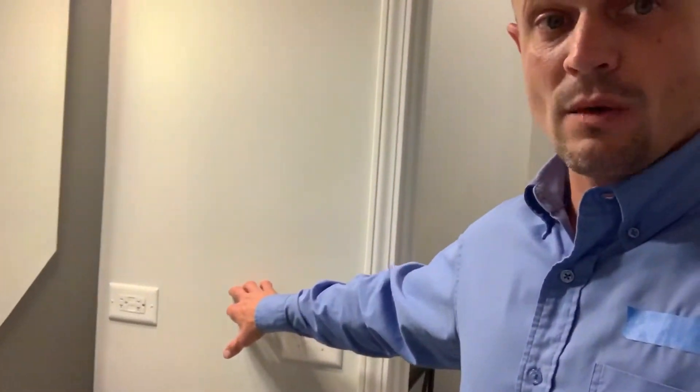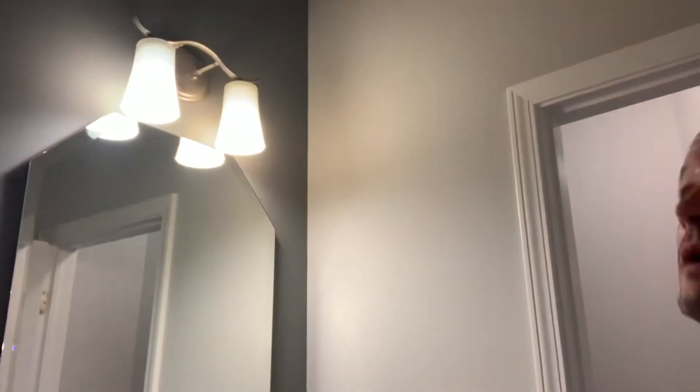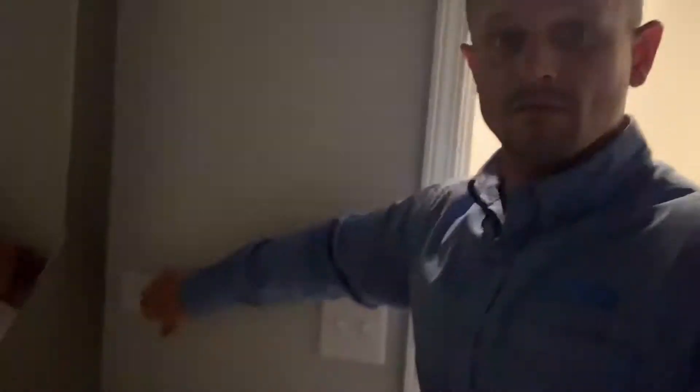You will have no power — the outlets, the garage door opener, lights — it basically shuts down the way that the GFI is wired in the garage, as well as the bathroom we're in. Anything downstream will shut down. So we're in the bathroom, we've got the light on, turn the fan on, and when I test this GFI and I trip it, it shuts down everything.